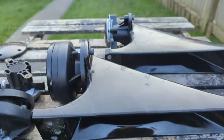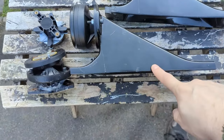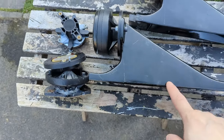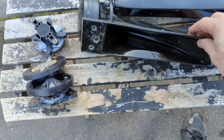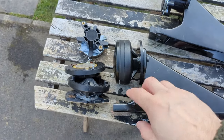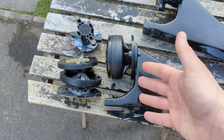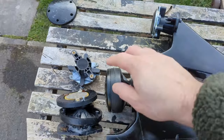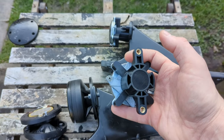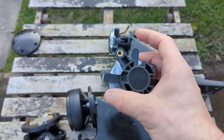In this video I'll compare the frequency response and distortion between the two drivers. We saw some very nasty dips and peaks around 6-7kHz, and I want to know if that's caused by the piezo driver or the horn's own characteristics. I remeasured the originals and the frequency response didn't change between the faulty and good one - only the distortion at the low end differs.